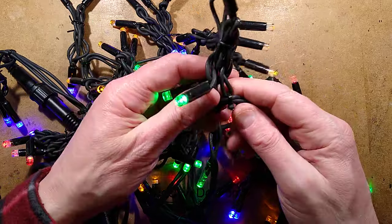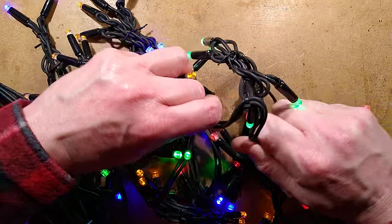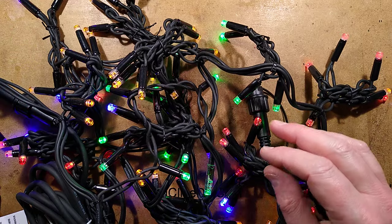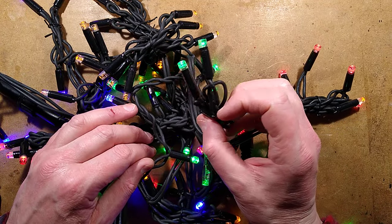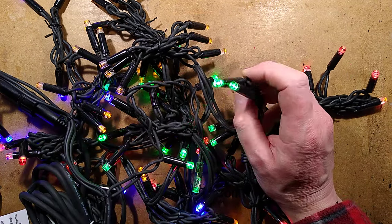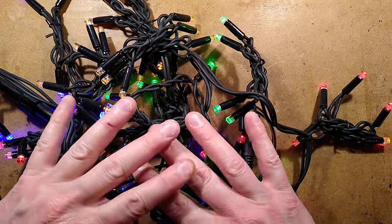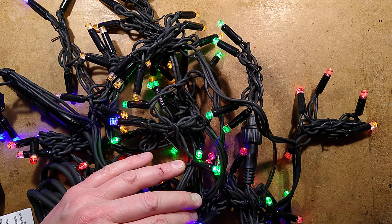That is the typical construction of these. Now when you go up to municipal Christmas trees or look at the frames on the side of lamp posts, you'll recognise the little plastic cap with the heat shrink, the LED at the end, and that thick rugged rubbery cable that just lasts forever — it's amazingly weather resilient. On bigger Christmas trees, because the cable is much thicker, made of rubber, and has that extra strain relief, it tolerates quite violent weather. These cost a fortune compared to consumer ones — maybe five to ten times more expensive — but they're a lot safer, more rugged, easier to install in larger runs, and they just last longer. That's kind of important in municipal lighting.